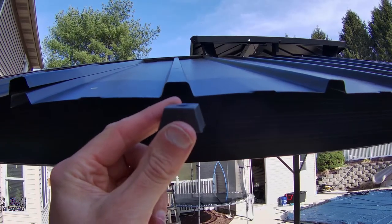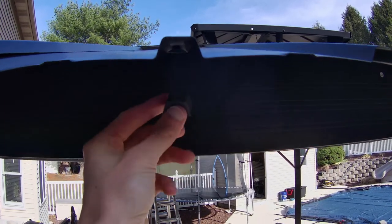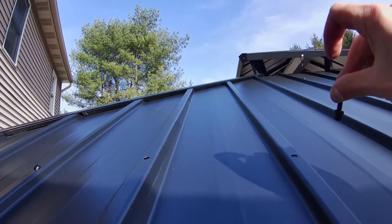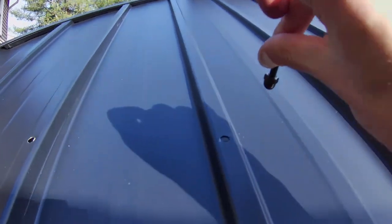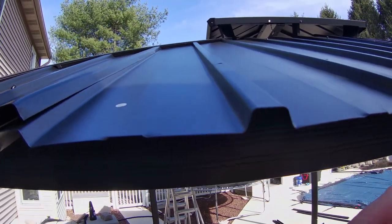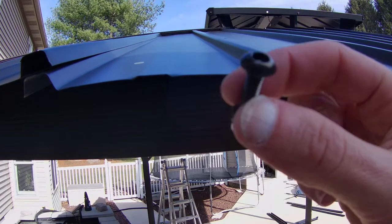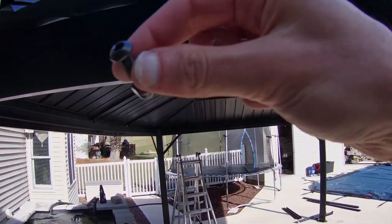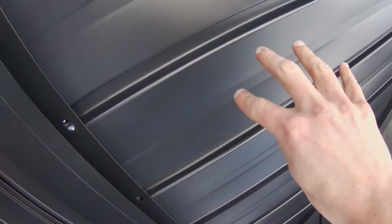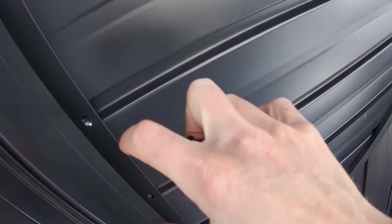One of the most difficult steps, and it's towards the end, is you need to put these little block pieces in between the beam and the railing. And you put a screw down in that hole up there, and there's another hole in the beam. Well, the holes aren't symmetrical from the sheeting down to the beam, so what you need to do is push the screw in on an angle, start screwing it in, and you lift up on the sheet in order to get that leverage for the screw to come through on an angle.